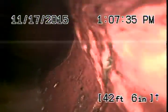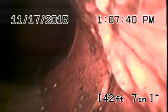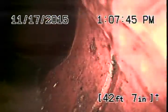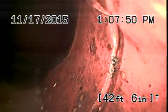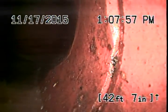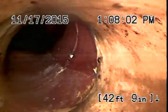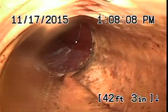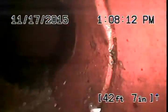We went ahead and traced out the line and the city connection is on the opposite side — the opposite address is 4493 and 4485. Right in the middle of those two houses is the connection to the city, and it's about eight feet deep. I don't see any problems right here. The only thing is that in the future, roots might come in here with liners, but at this point that connection is good.